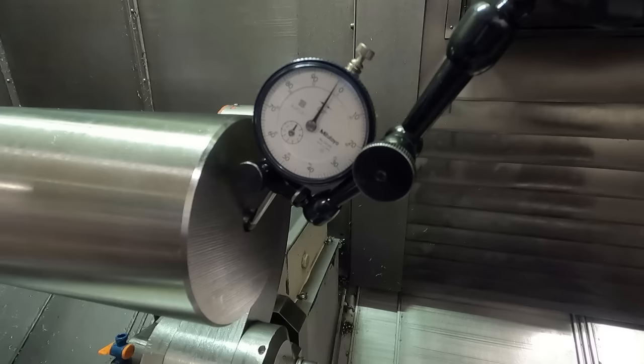And also this kind of helps you get the part in the chuck, believe it or not, because with this long shaft going up in the spindle, there's no way to balance this thing too good. And so if you put the strap on the other side of this bushing, it's about a half an inch thick on the radius, and you can kind of start it in the chuck jaws here with a strap behind it if you have a thin strap, and then you could pull the strap out and wiggle the part in there. Otherwise it's extremely difficult to get this long shaft up in the spindle and balance it.